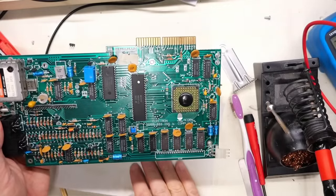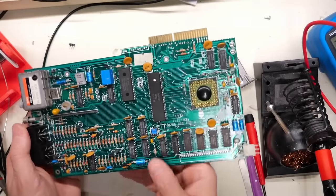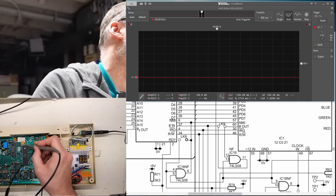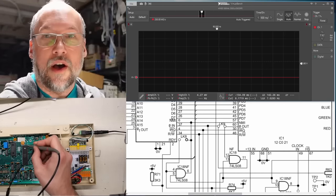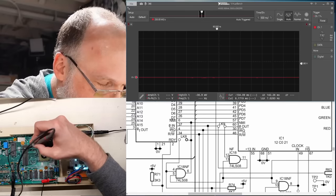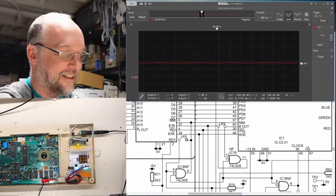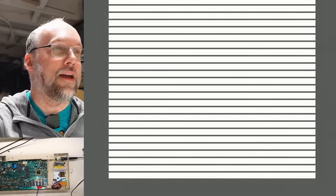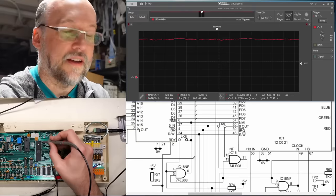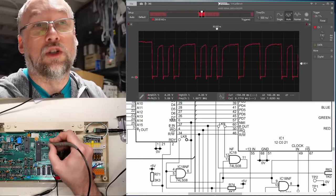Now that the ULA is properly seated I can at least check the clocks. We still might not have operation due to the Rockwell CPU potentially being the wrong one. I'm on the reset pin of the CPU — plugging in 12-volt power. Whoa — we're out of reset! How about the clock? Oh, we're getting activity — we are freaking getting activity! The reset signal looks good, and you can see the clock halting behavior — it stops high. This thing really seems like it's trying to run. Checking the RAM chips — there's normal-looking activity.